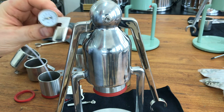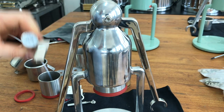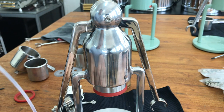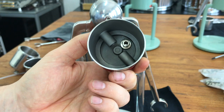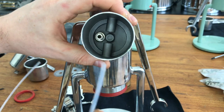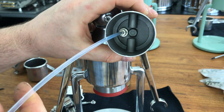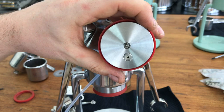The idea was to have it here — you just unclip it, it's fixed on with a couple of set screws. The pressure reading comes from the face of the piston here, and there's a push connect fitting in there. These are from Italy — it goes in there sealed with a Viton O-ring, and then it uses industry-standard 4mm OD pneumatic tube. This is from Parker Legris, rated up to 20 bar pressure and over 100 degrees C, so for our purposes this is more than plenty.